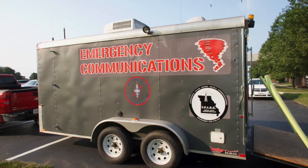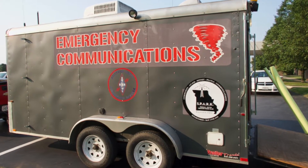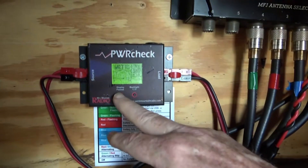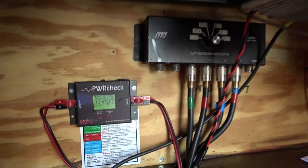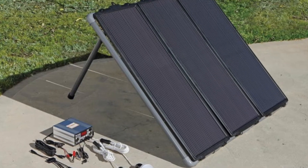What we have is a small trailer, 8 by 14 foot, and it's totally self-contained and self-sufficient. We receive power from a 110 generator, which we keep over here in the corner and put outside. We also have a small block that regulates it, kept underneath here. It hooks up to 12 volts from four 6-volt batteries, 110 via a power supply, and solar power — a 25-watt solar panel. All three of those electricity sources go into this one regulator.